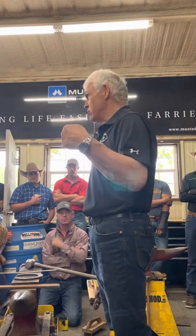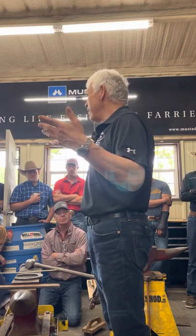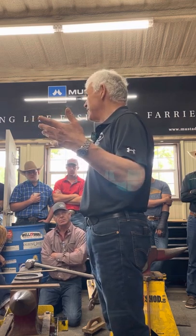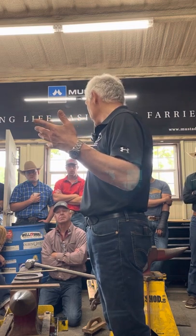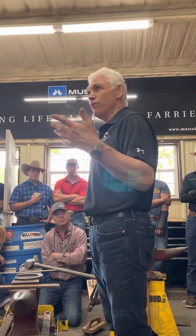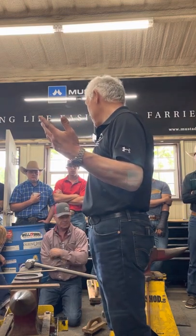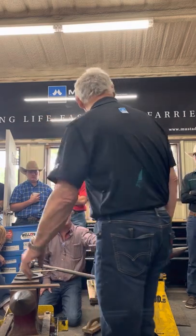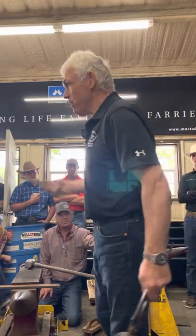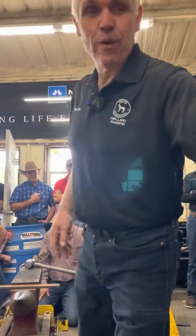So measure the width of the foot. Some say, oh, I'll guess it. I could be pretty close. Well, 4 1/8 is 4 1/8. It's not 4 inches. So you just walked over to that horse with a 4-inch wide shoe. You're going to walk back and you're going to make it 4 1/8. If you don't measure it, you're going to make it 4 3/8. And then you're going to walk back again. If you just like walking around, you see it all the time with people at certification, trips to the horse, to the left front. They've got to the right foot, yes. So it's always good to measure. Nothing wrong, no shame. If you're around me much, you'll find my ruler lives in my back pocket.